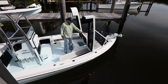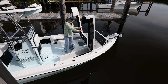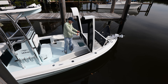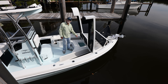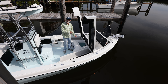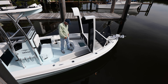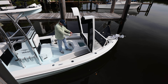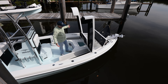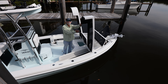Starting forward, there's the Power Pole Move trolling motor, then the forward anchor hatch — a substantial size with plenty of room for about 300 yards of half-inch rope. Moving aft, the full beam storage compartment has a spot molded in for a cast net bucket. A three-and-a-half gallon bucket fits below the recessed area, completely out of sight with a flush surface. Full beam width is typically used for day bags. Moving further aft, there's a 35-gallon live well with adjustable drain and fill.